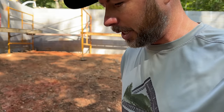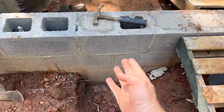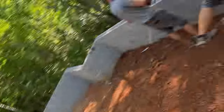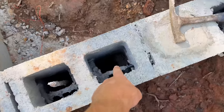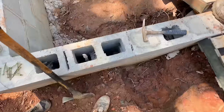Another thing we need to do is put in a sewer sleeve right here. That'll allow the sewer line to go through our foundation and out to the septic tank after we pour the wall. We're going to put a six-inch sleeve in for a four or three-inch sewer line. Unfortunately we weren't thinking ahead and wasted some extra mortar in these cores, so now we've got to move the hole over.